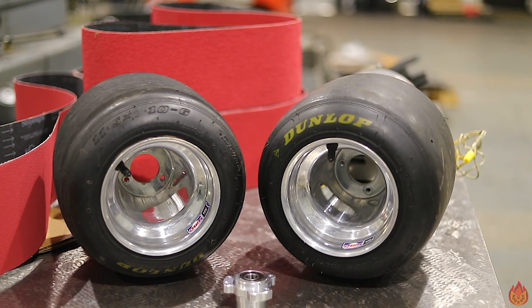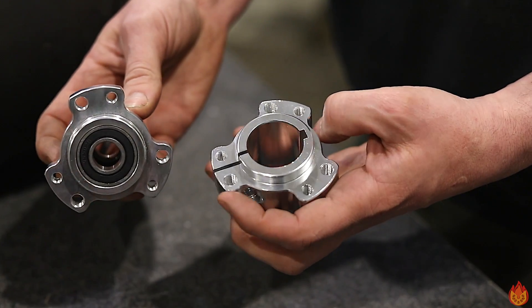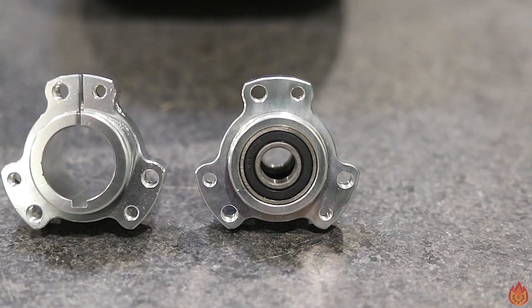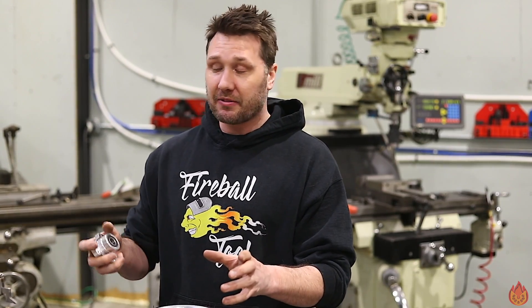You have two different types of spindle hubs. One of them actually drives the wheel and this inside bore you can get in a couple different diameters — one inch, inch and a quarter, probably even inch and a half. The spindle that free-rides has a 5 eighths hole diameter with bearings. On go-karts they actually just weld a bolt to a steering hub. We're just going to turn something out of 1045 mild steel. Let's start with that first.